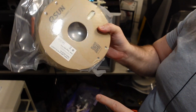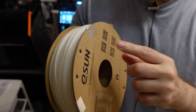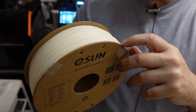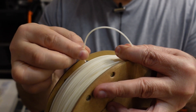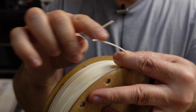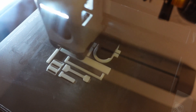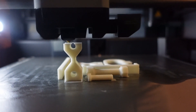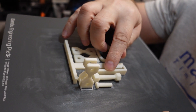I'll calculate the maximum flow rate from the recommended max speed. These are marked with letter H. The glass fiber version is in the same natural color, but the end of the filament is glued — they didn't use the holes, which usually means a brittle filament. Testing the bend: it's brittle but acceptable — it won't break inside the PTFE tube. The flow rate from recommended speed comes to 24, but I'll reduce it to 18 to ensure proper melting. The movement is much faster, the printing is nicer, bridging is very good, and the finish is perfect.